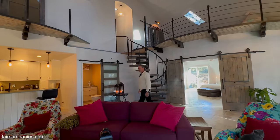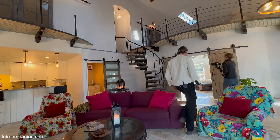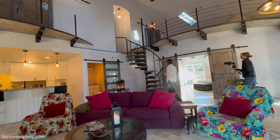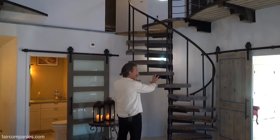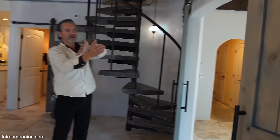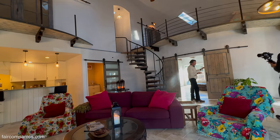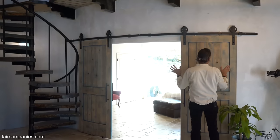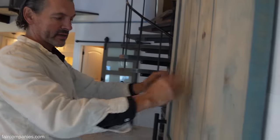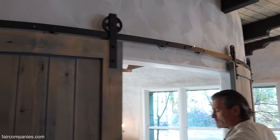This is all new here with the spiral staircase — it wasn't really functional before, so I put that curve in there. It's a six-foot radius wall right there — a serpentine wall. From the point of the stairs I did the circle, and that's how the circle wall ended up being exactly six-foot radius. Then it reverses direction and curves the other way. These doors are actually built with a curve on them too — a five-degree angle cut — so they follow the wall.